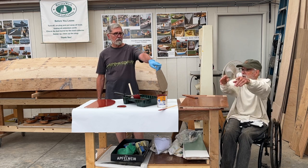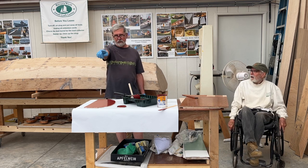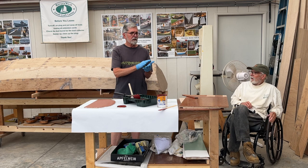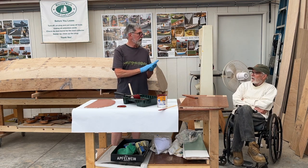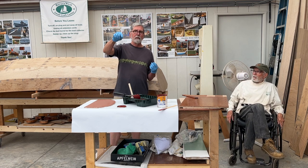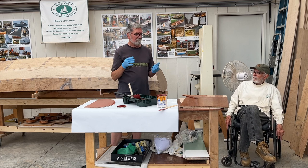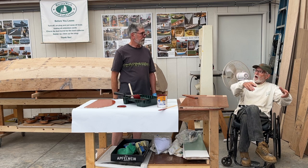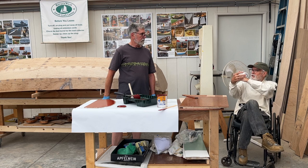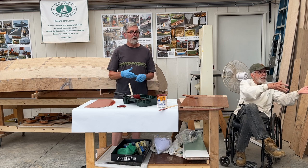If you want technique for its own sake, go crazy with 10 or 12 coats. But there is absolutely zero UV protection in epoxy. So to get good UV protection you need seven, eight, nine coats of varnish. Unless the boat is always stored dry and used a couple times a year — then you don't need UV protection. If you're sailing the Caribbean, then you do.